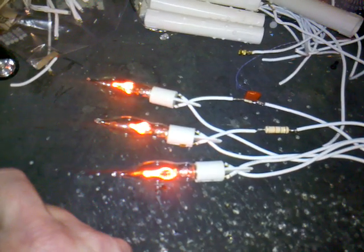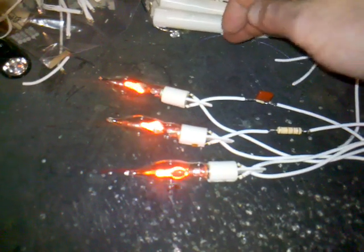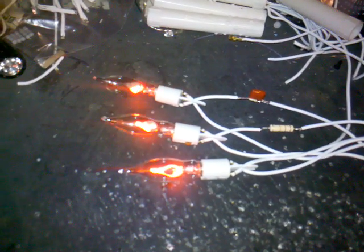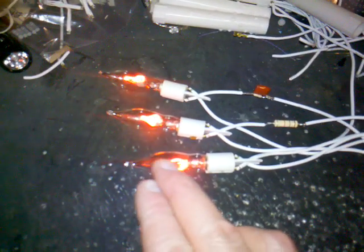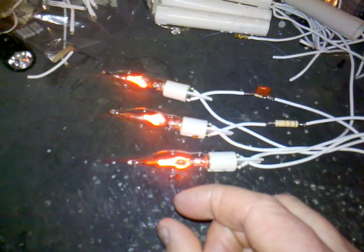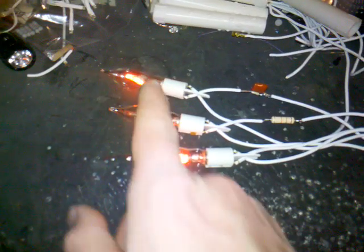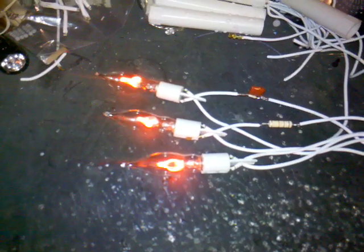The main advantage is that the lamps will last a lot longer and the bases don't get so hot. If you're doing this in America with a 110V supply, you could probably get away with a 200V capacitor, and you'd probably have to change its value to something closer to 220nF — though I'm not 100% sure, you'd have to experiment. If you limit the current too much, the discharge stops covering the whole flame and just goes into a little area at the bottom — right down to fractions of a milliamp it will still light, but it will just be a little dot. So that concludes tonight's experimentation with neon Flickaflame lamps.